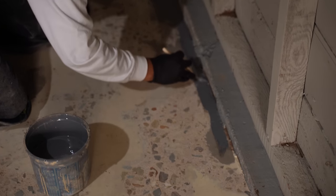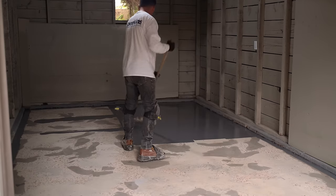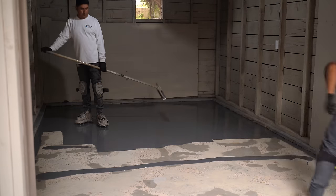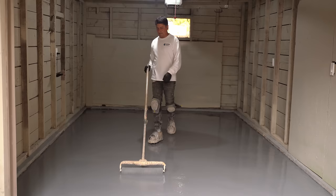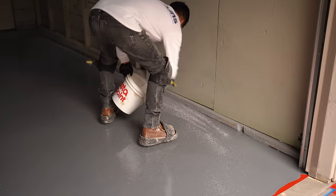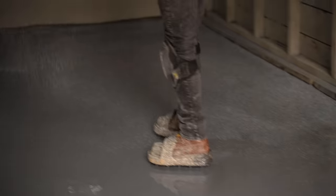Now that we're finally at the step where we can put a base coat down, it's an epoxy base — because epoxy is basically the best style of base coat you can put down. The polyaspartic comes after the base coat and the chipping. Watching the epoxy get rolled on and this nice smooth coat go over the top of the garage floor is just such a satisfying feeling. I chose the coastal blue paint chips to spread over, and the team wears awesome spike shoes so they don't mess up the base coat they just walked on.